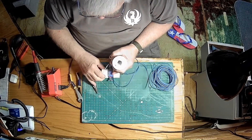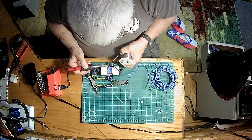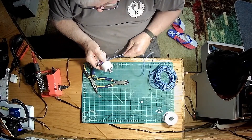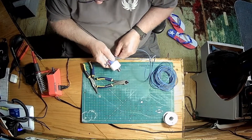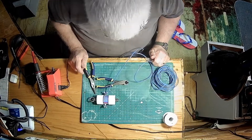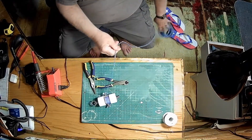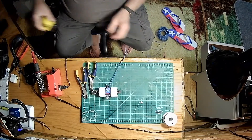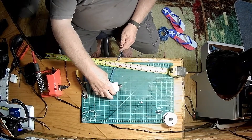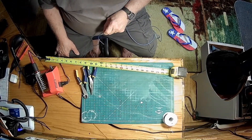Please don't judge — I'm the worst ever solderer. Now, I intend for this to be a half-wave antenna. Half-wave 10 meter antenna. We'll need a quarter wave on either side — so 8.2 feet on either side. The reason being that we might need to make adjustments. You want to be sure you leave room to make adjustments. So let's go 8.2 feet.